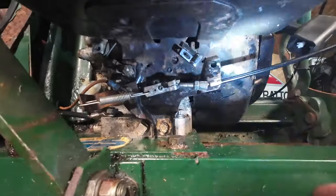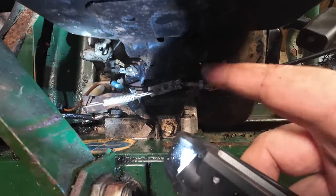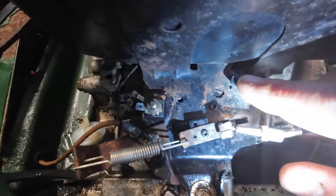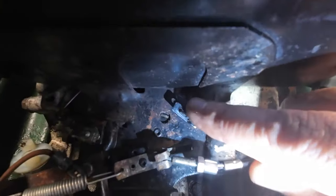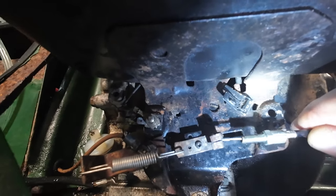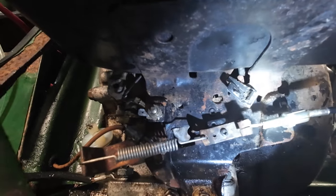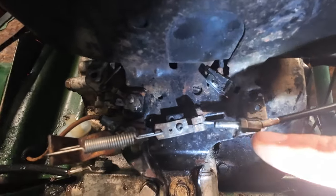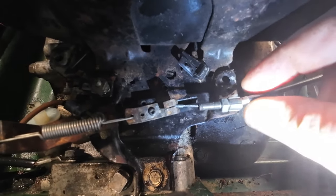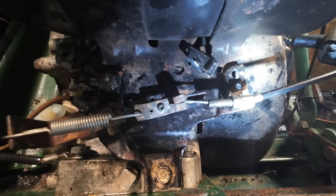So I've just got a bit of throttle work. As you can see here, I've got this little bit here that doesn't belong — that's restricting the throttle because the machine will not actually physically turn off. Now when I activate the switch — the dead man's handle switch — that's now off because you can see the little tiny black bit in the back there. When I pull that, you'll see it moves away from the switch but it wasn't making a good connection, so there's a bit of slack there. I can't get any more throw on this throttle to rev it up without that causing problems. So I'm just going to remove this cable again and take this bit off because it doesn't belong on there.